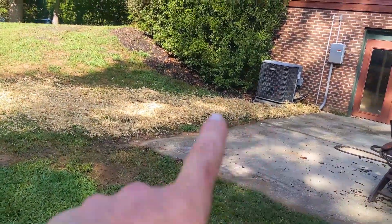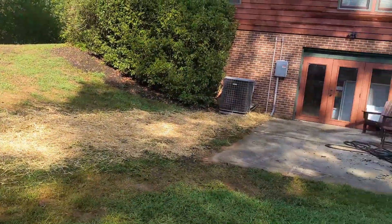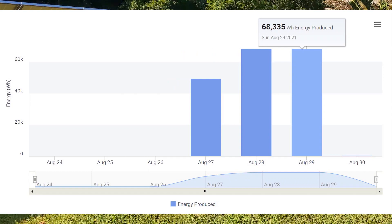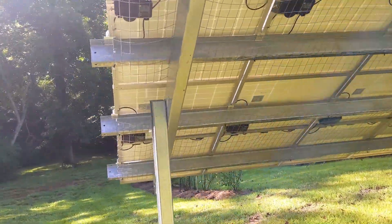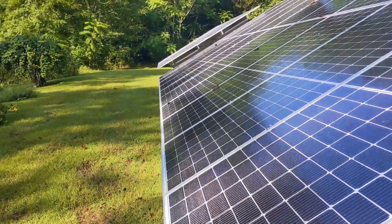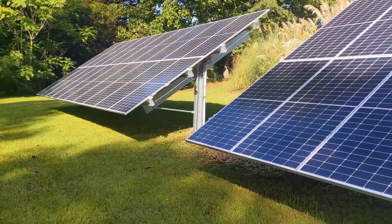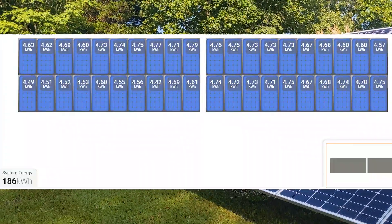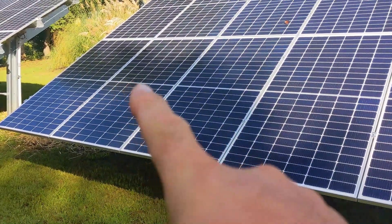Today is commissioning day. Final touch-up: making sure the trench is fully packed, seated, and straw-strewn. We turned the system on — it's sending power back to the grid. Explaining to the homeowner: when the arrow on his meter goes left, he's pushing power back. We're going through the Enphase Enlighten app and Enphase Installer Toolkit, checking every box. This is where IQ7 micros shine — there's shading on parts of the array that would greatly affect a string inverter, but with micros each panel is individually controlled with individual MPPT tracking, so shading is mitigated.